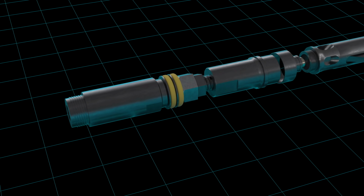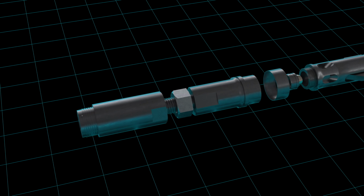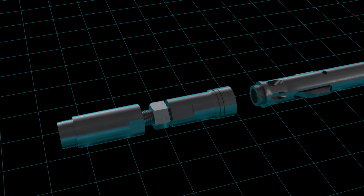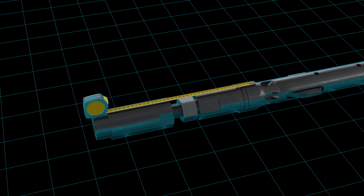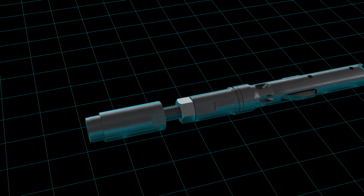Next, remove the lower latch body from the spindle and replace it with the adjustable tube adapter provided in your kit, while retaining the landing shoulder and landing indicator ball. Measure the back end and adjust to the same length as the original. The adjustable tube adapter is now at the proper length to allow you to direct water through the inner tube.